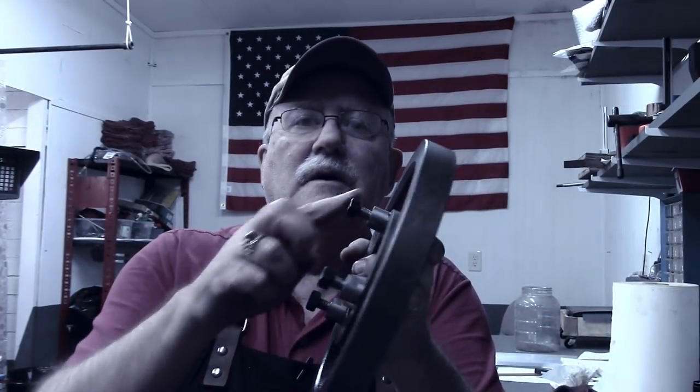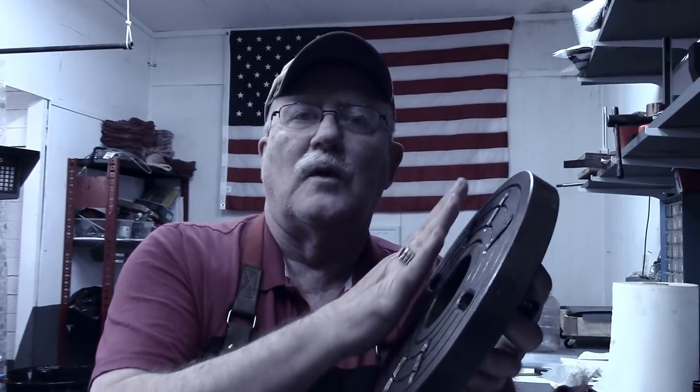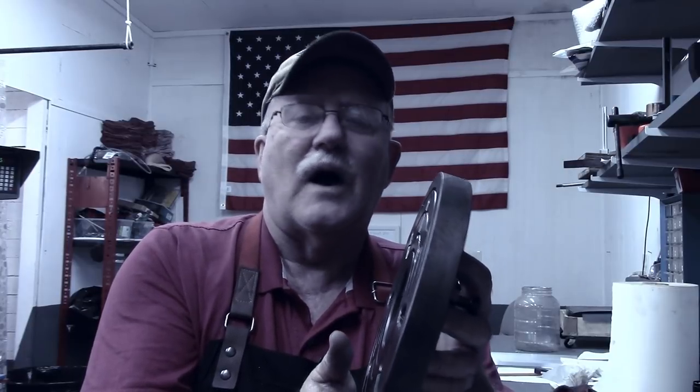In a previous video you also saw me make these mounting bolts for the face plate on my lathe. Several folks made good comments on that video — I was actually surprised with the number of views it got. A couple comments were about probably needing to test for runout. I did turn it on and felt just a minor bit of vibration at about 600 RPMs. After the comments I went back and checked the face itself, and was very pleased that there was only just a little over one thousandth runout on this nine inch plate.